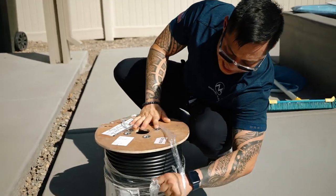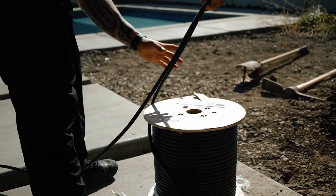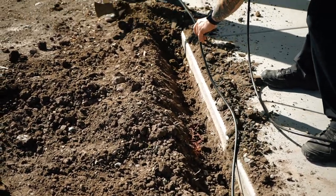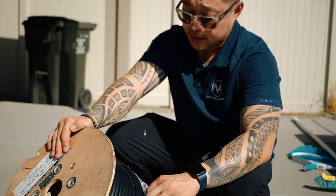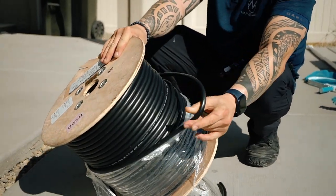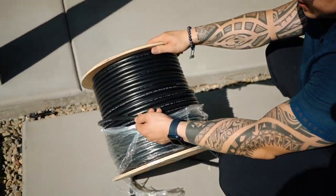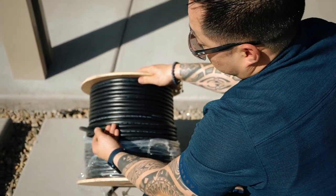What I'm unwrapping right now is burial-grade speaker cable, 14-gauge 4-conductor. 14-gauge is a very good thickness to ensure that the signal gets to all the speakers to provide high-fidelity audio throughout this backyard. As you can see, the speaker cable is very thick — it's able to withstand the elements outside, and if landscapers nick the jacket, it will survive.